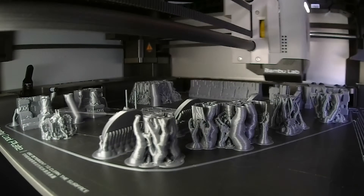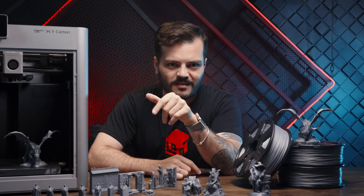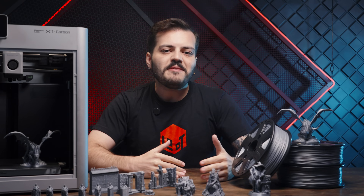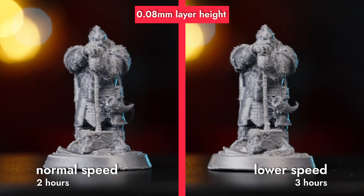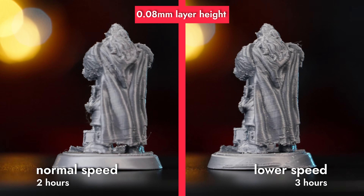When printing with filament, a determining factor is the printing speed. We know this machine is an unleashed beast when it comes to velocity, but if you're printing smaller parts, reducing the printer speed will help increase quality. After all, rush is perfection's nemesis. The printing speed is the key difference between the high quality setting and the extra fine at 0.08mm height. Printing with the high quality preset at lower speed, the printer needed almost three hours for both models, and we didn't notice any great difference — the Bambu X1's stabilization system handles faster printing really well.